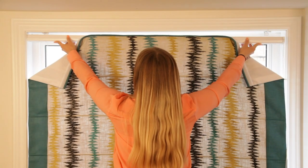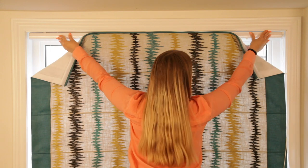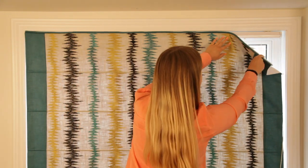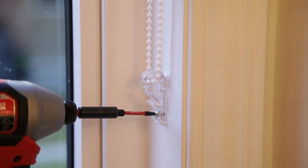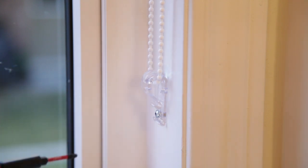Place the mechanism — which is the top part of the shade — into the brackets and flip the lever to secure it. When attaching your Roman shade, place the piping above the mechanism to ensure there are no gaps. If your Roman shade came with a chain, it is important to attach the safety chain lock. After you raise your Roman shade and attach the safety lock to your chain, install it in the middle of your window frame, making sure that the chain is tense enough.